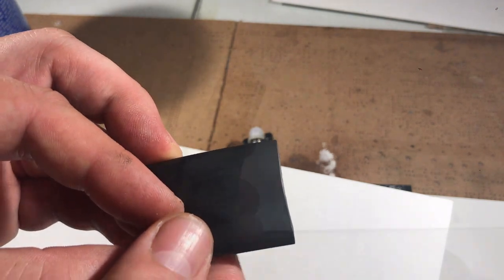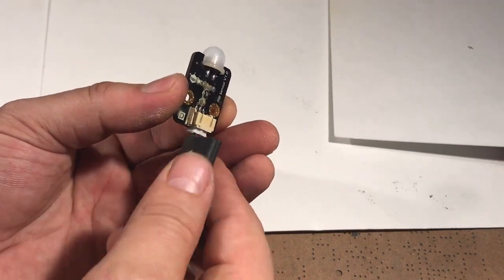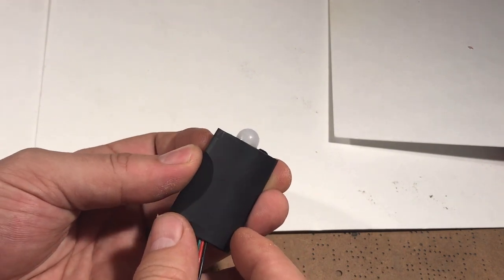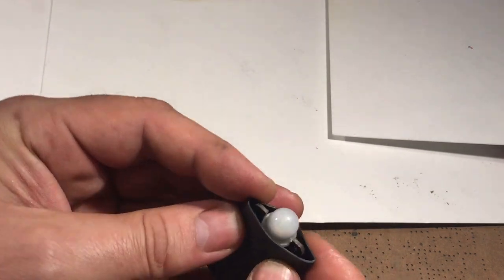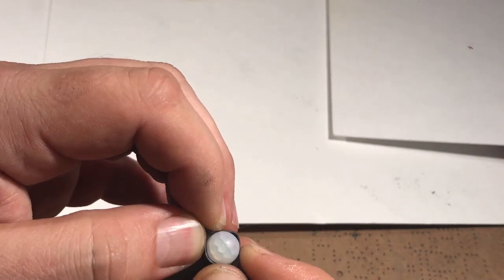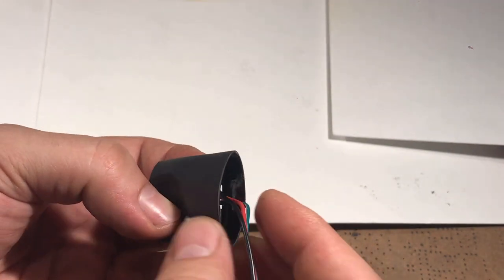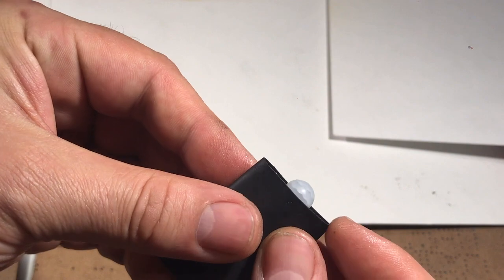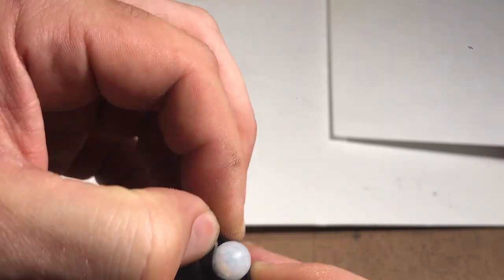With our motion detector and sealant dry, we're going to take our piece of rugged heat shrink and slide it up. We don't want to cover the whole sensor — we want to leave a good amount exposed — but we want to get that glue up over the PCB board. We want to keep the tip out, and we want to be careful when we heat this up so we don't melt the plastic. We want the back to cover the wire, so position it so the glue from the inner lip can touch the other side, because you'll be pushing them down together once they glue.